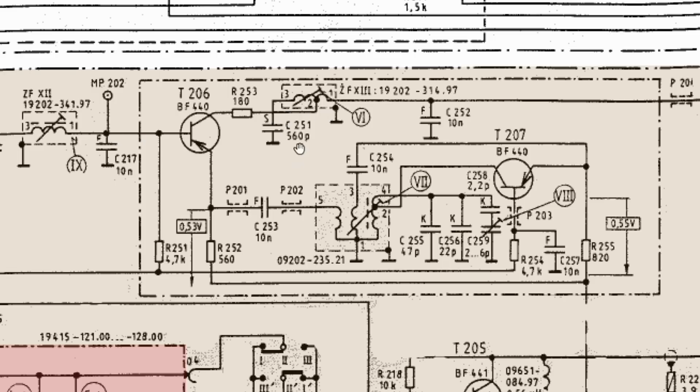coming through with the tone on it. You can see it at the output, and you know this thing is perfect. And the way to do that is you adjust it with that till you get a maximum. And because the range is quite wide, you can then go here and go to fine tuning and adjust it to a peak, to the best possible amplitude out there. So you know this thing is as close to 2.46 as is humanly possible. So let's go look at the board and see where we're adjusting.